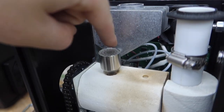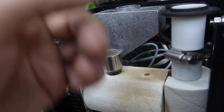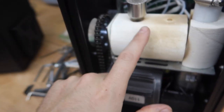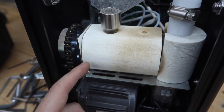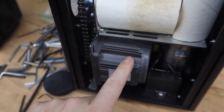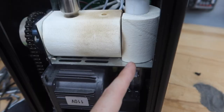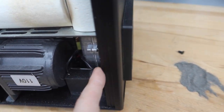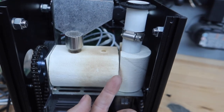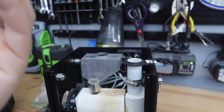There is a motorized chute that goes from the hopper into the actual heated chamber. A little screw wheel activates — there's a motor that turns it, pushing the powder into the heated chamber. There is an electric coil that heats around the chamber. Then another motor turns a second screw wheel inside the heated chamber, pushing the now-heated powder into the chute. The chute has a big fan on the bottom that blows the heated powder out, and the reaction of heated powder hitting the air causes the spark effect.